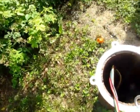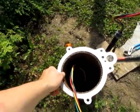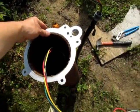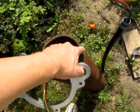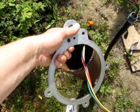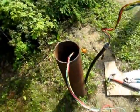When I put this on, this is the ring for the bottom flange for the well cap. This is a Trago well cap. I paid extra for this. It's a little tight. That might be because of when this was cut off with a torch back when it was installed, there's some slag and stuff there. Plus the inside of this is a little rough. So I'm gonna try filing that down. See, because I don't have a die grinder. But it might be a good excuse to go get one. So we'll see how this goes.